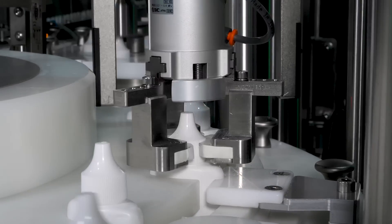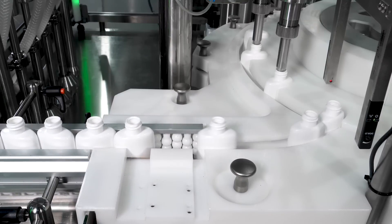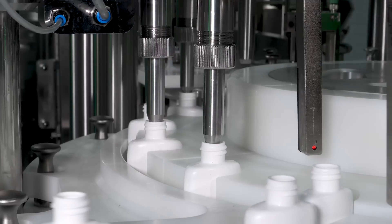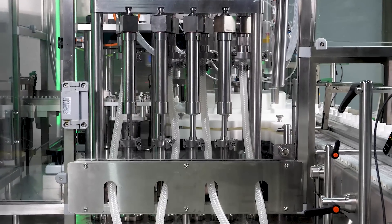There is also an option of purging empty bottles with an inert gas, which reduces the oxygen content considerably. Once a fill cycle is complete, a second purge of the headspace further ensures low oxygen content inside the filled bottle before capping.